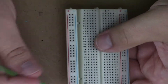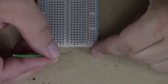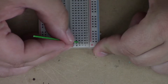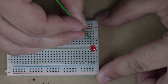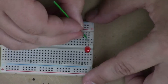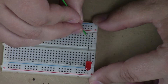The power rail is connected vertically, but the main breadboard area is connected horizontally. If you look closely, pin 30F is connected electrically to G, H, I, and J — all of these are connected. So if I were to put in an LED, say positive right here and negative into this row, and I wanted to make an electrical connection from the positive to the positive rail, I could plug it into here, here, here, or here — it doesn't matter. All of these are connected to this lead of the LED. Same with the negative — all of these are connected together.